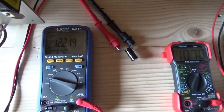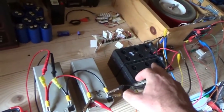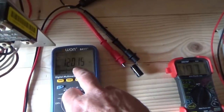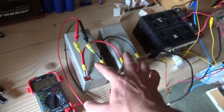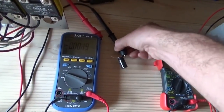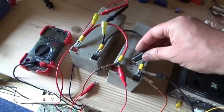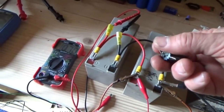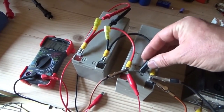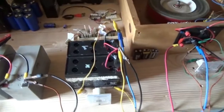I'm going to experimentally put it over these batteries and see what happens, then try it in series. Yeah, that voltage is dropping while I'm looking at the meter - these are really, really bad, they probably need water added. Disconnect that. When I put this capacitor over here it's definitely showing me these are bad batteries. Since the voltage of the capacitor is what we're seeing, I'm going to try putting it over a different set.